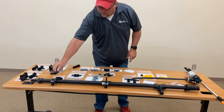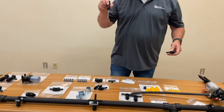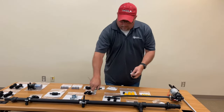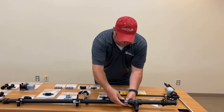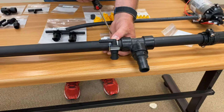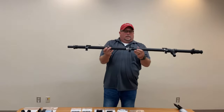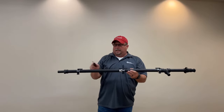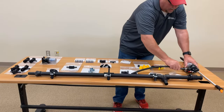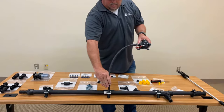So we would use two of these and one of the crosses, and I'll link all the part numbers on our website in the description. So let's just slap this on here real quick. There you have a three-nozzle body set up on a tube structure — considered a dry boom. All you're going to do is cut your pieces of three-eighths hose and attach those. Then from there you're going to run your hose to your pump, which we just simulated here. We do sell the pumps too. So that's what you turn on and it's going to spray.